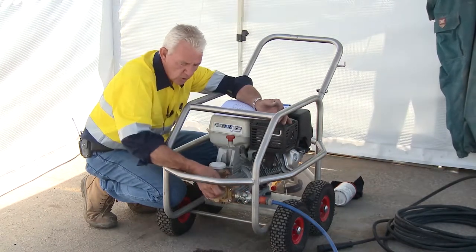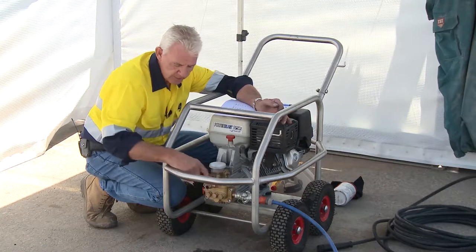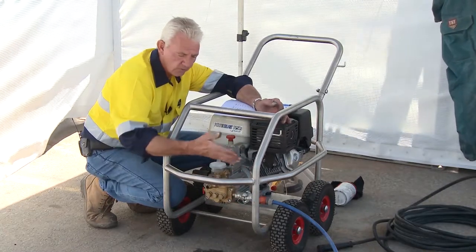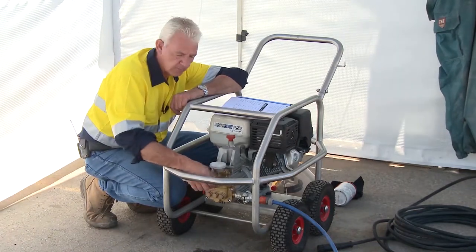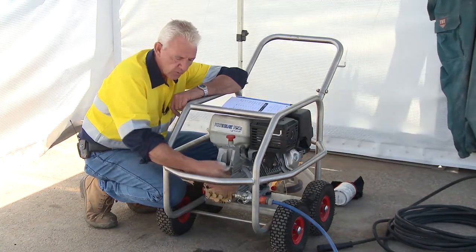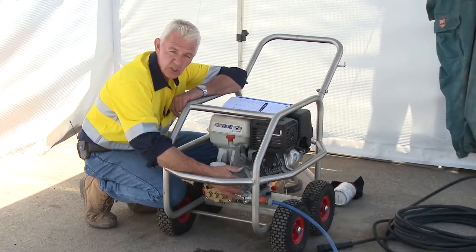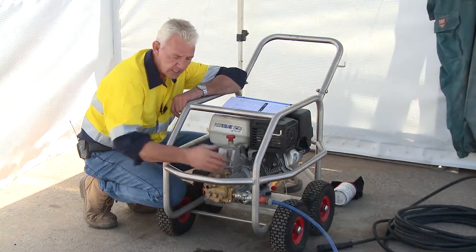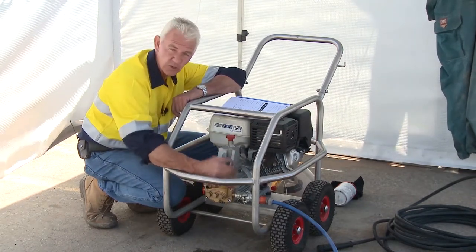If the pump starves for water, it can cause cavitation — a pocket of air that can be quite detrimental, particularly to brass surfaces, O-rings, and so forth. Without a reservoir, it's critical to maintain water flow. If you run out of water with this particular pump, you only have a few seconds to switch it off before it decimates the internal workings. These pumps are designed to pressurise and deliver water, not act as scavenger pumps.